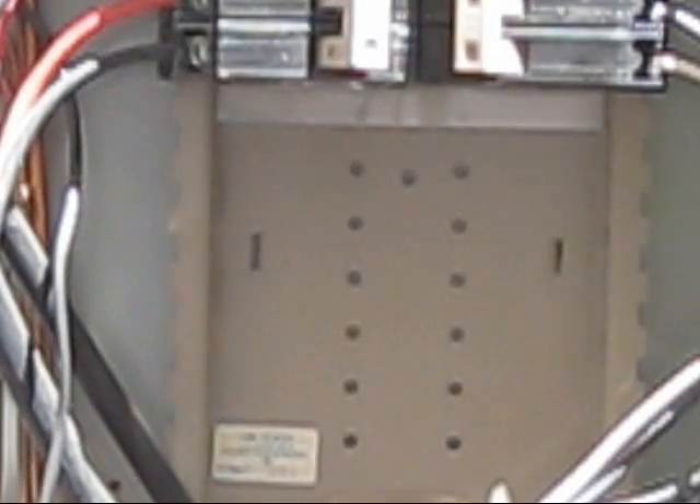If you look closely, you can see there is no place down here to add a breaker. Down here should be some contacts if you had additional room, but unfortunately my contacts stop right underneath here — they don't come all the way down. So I wasn't able to install it in this box.